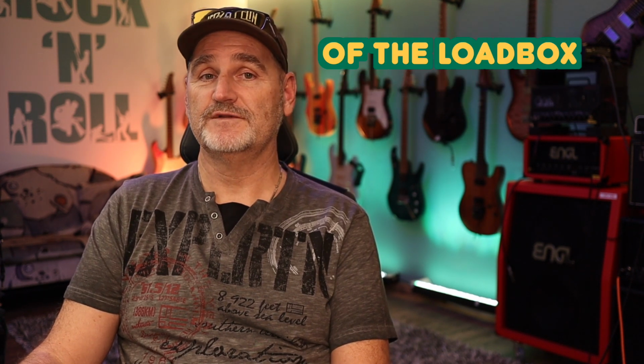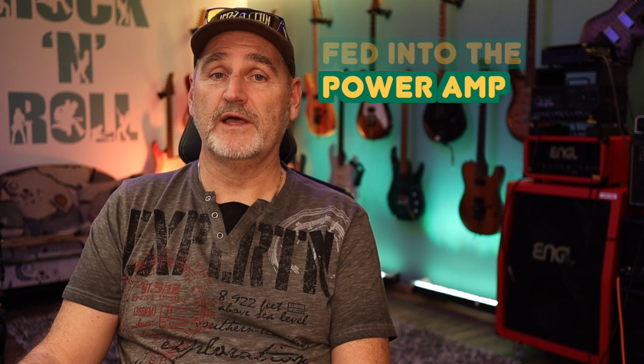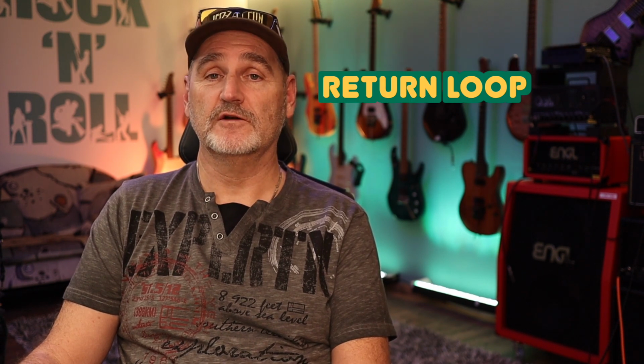Now let's take a look at the overall response curve. For this we compare the line out of the load box with the white noise input signal of the amp, which was fed into the power amp via the effects return loop. For more details please watch episode 1 of the series.